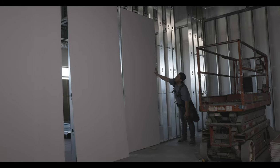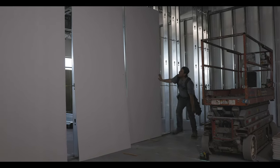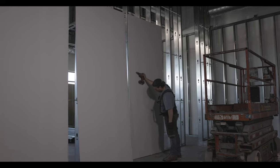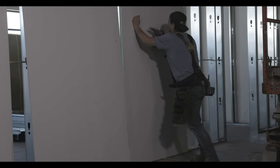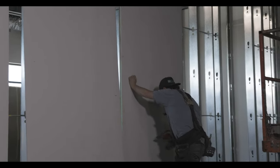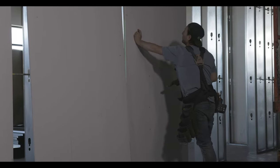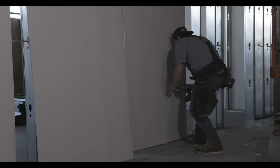For the sheets going forward, you only have to put your screws in the bevels. I put my screws every two feet in the bevels when I'm in the tack-in phase. I put four screws in the bottom track: one inch in from each bevel, and one inch in from the middle of the studs. Pay attention to where I put my screws — knee, waist, chest, reach. That's it. I don't get creative with my screws; I put them in every single sheet the same way.